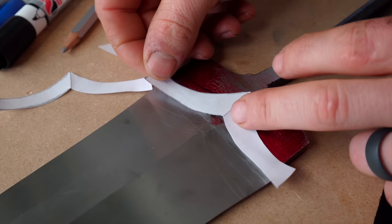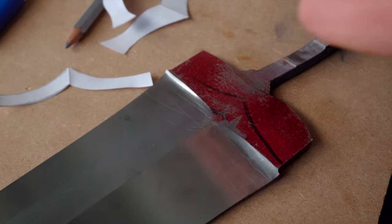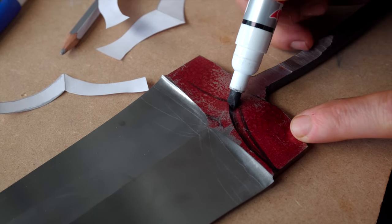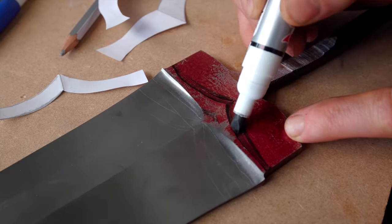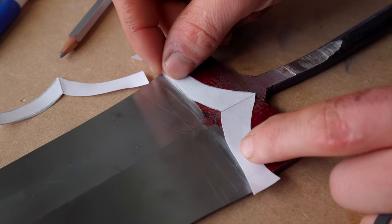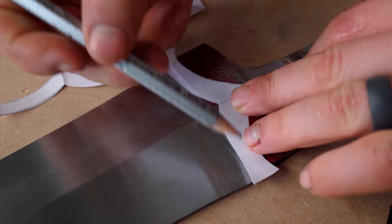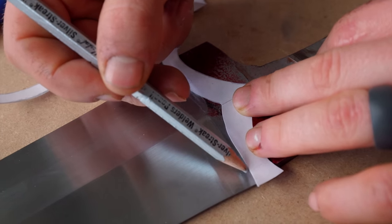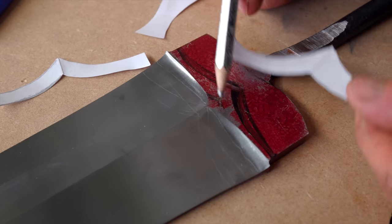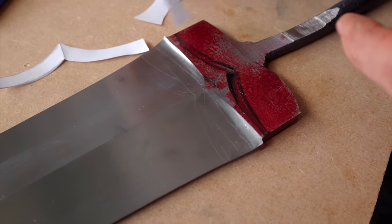Then when we started putting these things on, it begged a little question for us. My initial idea is that we were going to cut this tang area at this black line like this, and that was gonna slot into the bolster area of our handle. But we had a quick look at the originals again, and none of them look like this, because if we did this, there would be this unsightly gap between the edge and the mortise, since it'd be a square mortise to accommodate for all of this. It'd make it very practical for the making of the hole, that mortise, but it might not look really good.